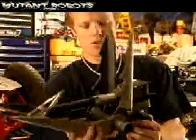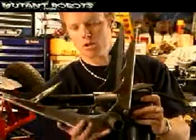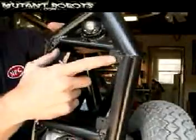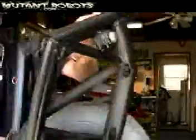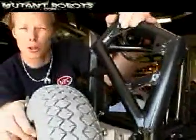Here is your weapon of choice. We're powering our jaws with a 1,000 pound rated linear ball screw actuator by Motion Systems. We've made the frame — you've seen us build that — and I've now finished welding it. We got the gussets on the frame, actually threaded with quarter-20s. We got a ball caster for our front wheels, and we've added gussets for connecting the two systems with isolator bushings.